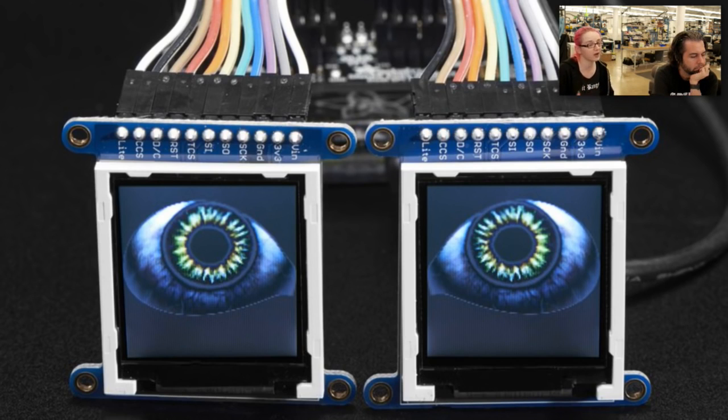He actually has two SPI ports going — he uses a secret SPI port available on the Raspberry Pi and uses that to control each one of them with DMA independently. On top of that, there's an analog-to-digital converter and some breakouts. So if you want to use a joystick or a light sensor, you can use a joystick to change the direction of the eyes, and the pupil will dilate. I don't have that demo set up. Do you want to show this? Yeah, let's go to the overhead for a basic demo.